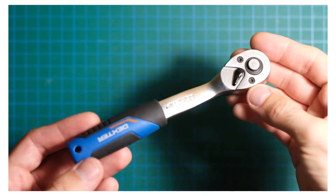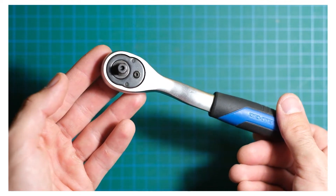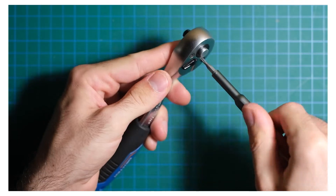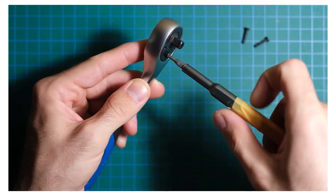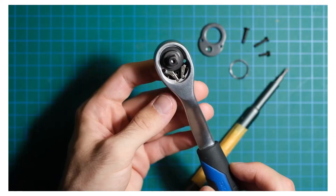The film advance mechanism is using the components of a ratchet wrench. Its goal is to permit the knob to turn in only one direction. That way, the already exposed film is kept tight around the initially empty spool. The first version camera relied on frictional contact between the knob and the lid to accomplish this purpose, and therefore the user experience was poorer, but simpler and functional.